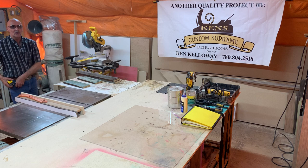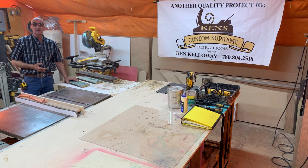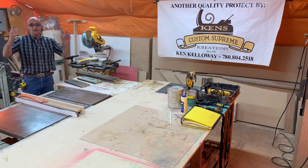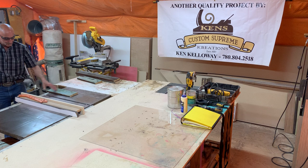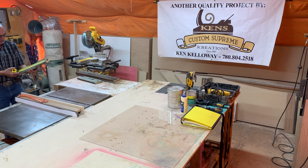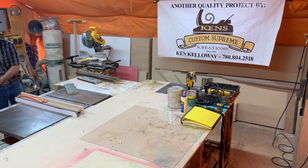To 2 inches wide when you miter them together, because even though the picture frame is going to be 11 by 17, we need outside measurements because of the 2 inches. We needed 15 and 21, so that's why we're going with 2 inches, because this stretcher here is 15 1/4, and that's going to give us just enough room to make our miters.